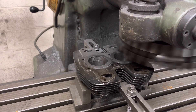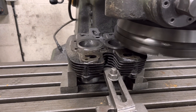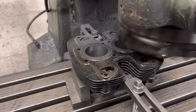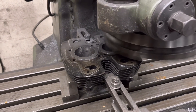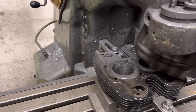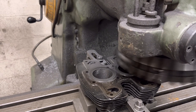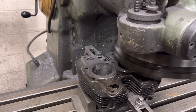So I'm still chomping away at these liners here. They were about 4mm oversize so you can only do about 10 thou cuts on this. It's a little bit of a Heath Robinson setup — there's nowhere really to clamp on these barrels, so I've had to put a bit of steel in between the fins and just clamp as best I can. I can't go too wild with the cut on it, but hopefully by the end of today it should be nearly there. Thanks very much for watching guys, smash the subscribe button and we'll see you in another one — cheers.